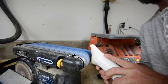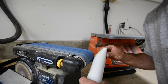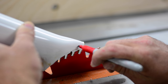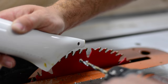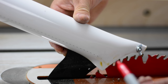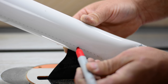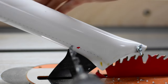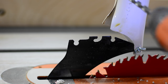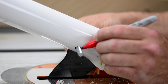I'm going to connect the nozzle to the riving knife in two locations: one right up at the nose of it with a number 10 screw and a wing nut, and then further back I can use a 5/16 T-nut to fasten that end. I chose a T-nut because it's really flat on one side, which allows me to get the fence even closer without anything getting in the way.